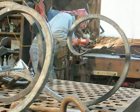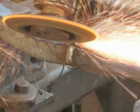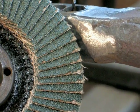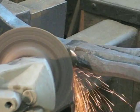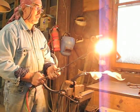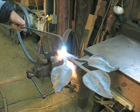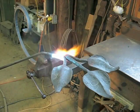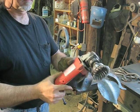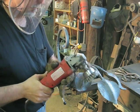After doing all of the welding, I come back and actually grind away with a heavy hard rock grinder on the very top layer, making sure that I don't do any kind of undercuts. Then I come back with a flapper wheel and actually refine my grind so it's nice and blended. Now comes the part where the real blending takes place. I come in and using an oxyacetylene torch, I heat up the section through a very orange heat, making sure that I heat everything up, and that basically forms a scale and blends everything.